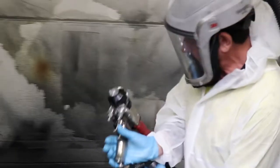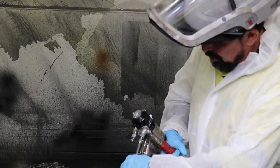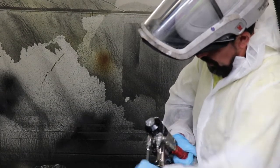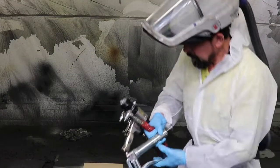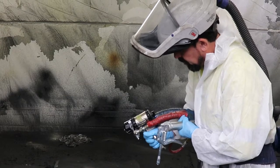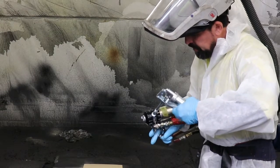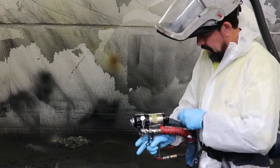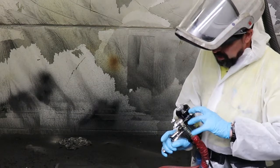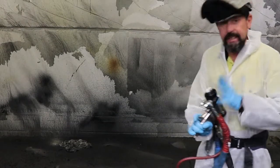Now that we've finished our passes, we're going to close off the valves. Then we want to remove any chemical that's left — get a couple of quick squirts out. With our grease gun, make sure we get some grease through. Then you can shut it down — it's ready to leave until you start next time. Make sure to put a bit of grease over the top of the tip as well, so any remaining chemical doesn't go off.